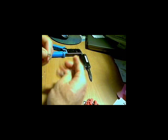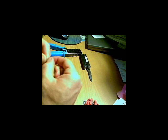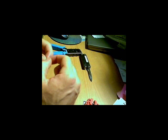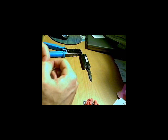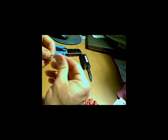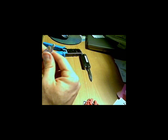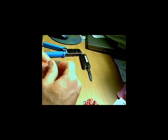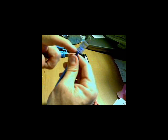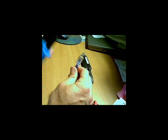Making sure you're nice and straight and stiff. All your wires should just slide right in. Sometimes you'll have to monkey around with them just a little bit to get them to feed in there. My orange and white orange one wants to flop around the blue one — that's always a pain. Get them nice and straight and feed them through. Check them: white green, green, white orange, blue, white blue, orange, white brown, brown. Make sure you got them all the way through and that your jacket is all the way underneath the strain relief thumb.